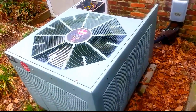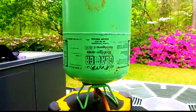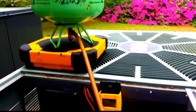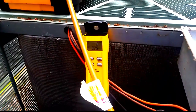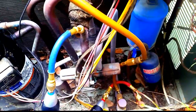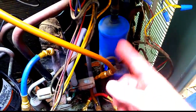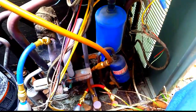Good thing we can reuse everything we just installed upstairs on the new unit. We are adding some refrigerant with the Fieldpiece wireless scale. Glacier R22 — good old R22. Add about a pound and see where we're at. More than likely the accumulator is pretty busted up there on the bottom — I think I see some oil around there, so that's probably leaking, maybe that among other things. We have a charge compensator, a dryer — all these things break down and start to rust and leak over time.